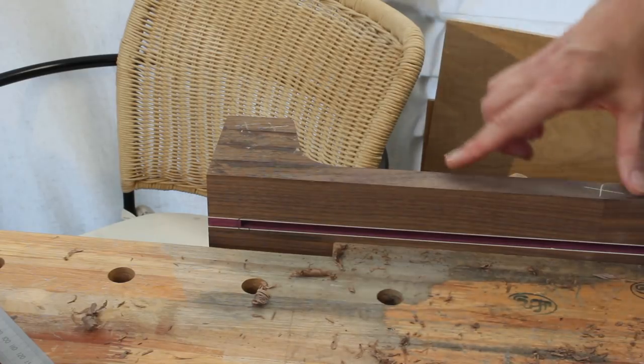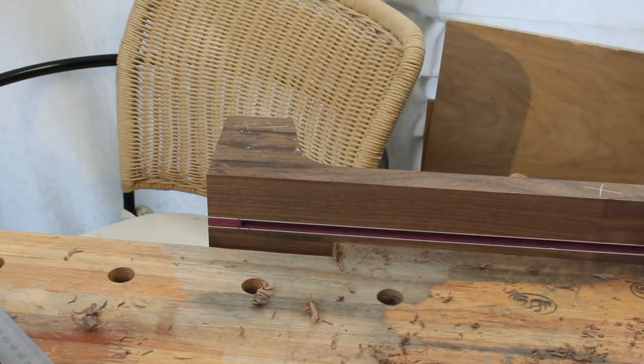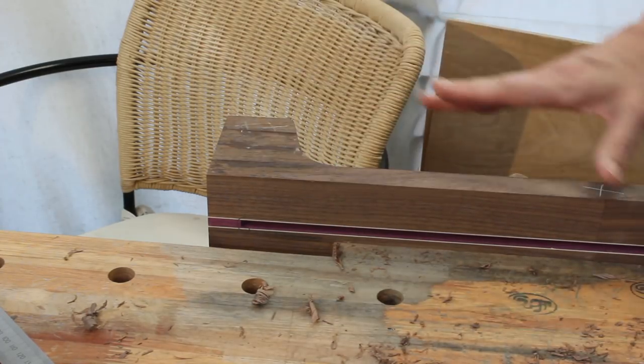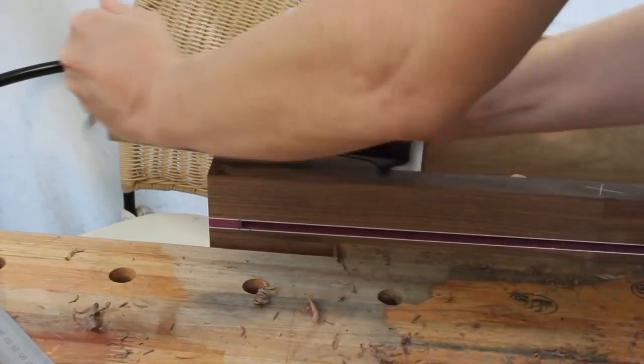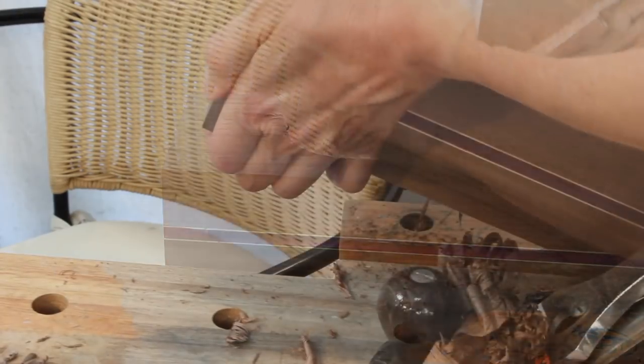A little bit more care this side. It's the same procedure, but now we're aiming to get the same width here, 35 mm, so we've got to take about 1.5 mm off in total, starting at these two bits. We are now square.